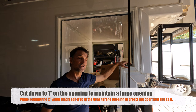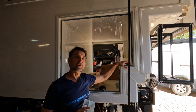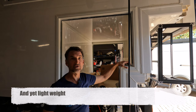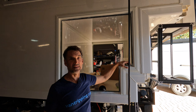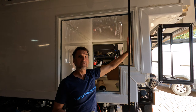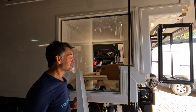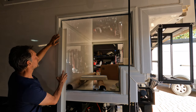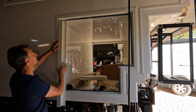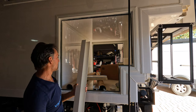This fiberglass angle material is rated for outdoors — it can handle sunlight, won't degrade, is made to replace wood and metal in outdoor environments. It is structural, incredibly strong, non-thermally conductive, doesn't absorb moisture, and is non-electrically conductive for the most part. These pieces create essentially my backstop for the protrusion that's going to be on the doors — that protrusion on the doors will mate right up with these pieces with seals in between, once I get the garage doors cut and all the protrusions installed.